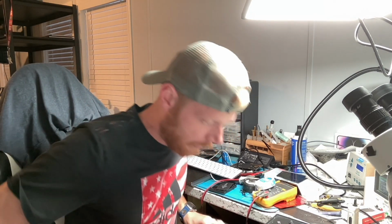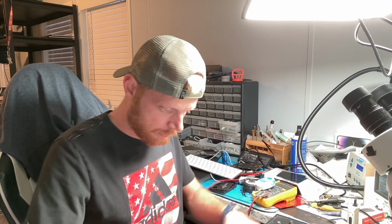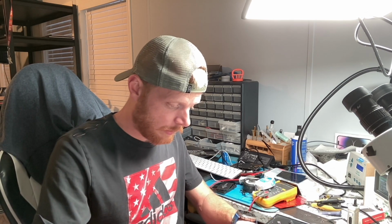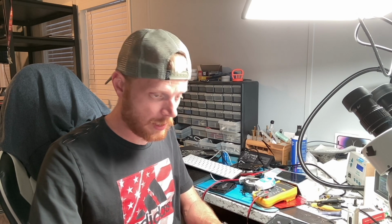All right, so we're gonna plug this in again on this side and see, do we get any change? Okay, so on one port, we still get dead nothing. It doesn't even turn on my meter. And on the other port, now we are getting that same 60, 126, 160, 200, and it's just kind of hanging there. So that's telling me that we should be good, except for one more CD3215. And if I was a betting man, I would say it's on the one that I haven't done yet, but we don't know, we still gotta test.